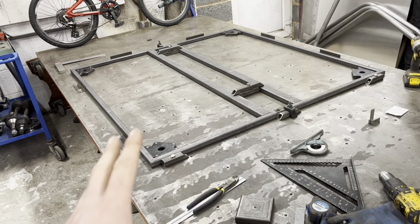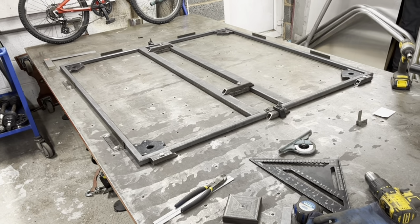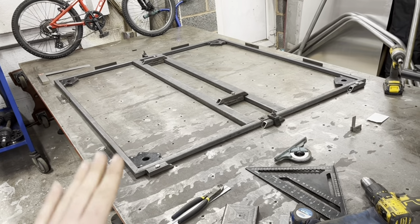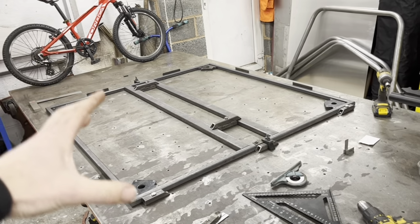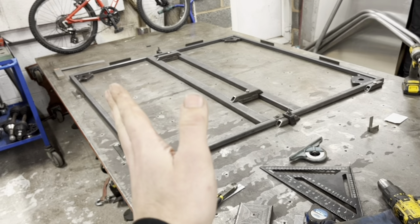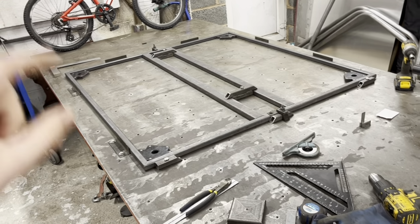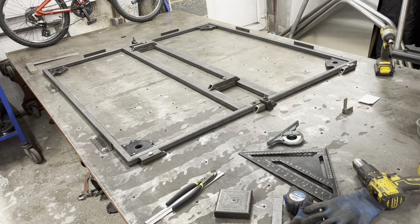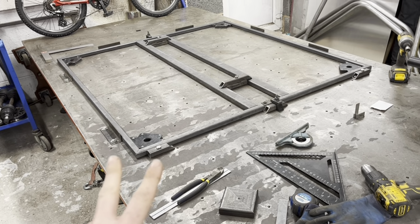I mean, yes, you can have a mill here and there, but ideally you want this square because everything works off this. The back suspension goes off it. The cage comes up off it. The front suspension comes up off it. The car drives square through it. So you've got no crabbing. Really, this needs your most attention to detail, right?